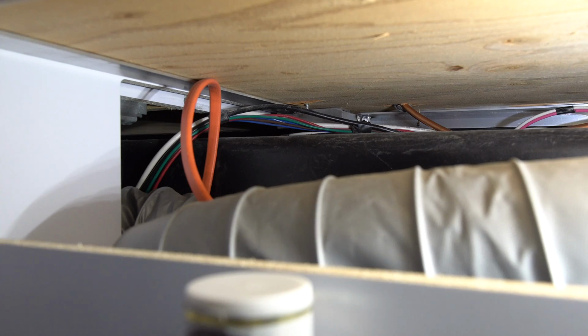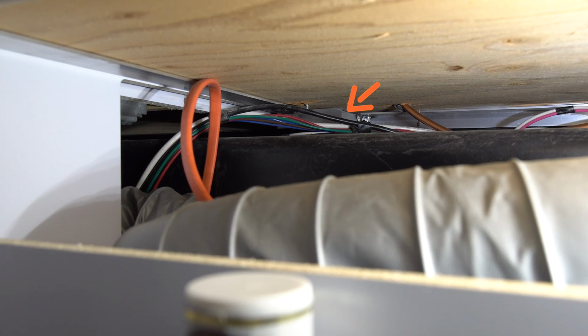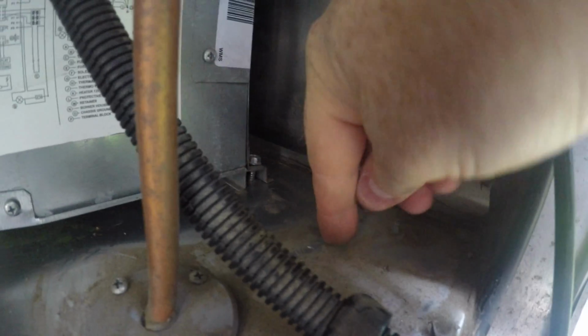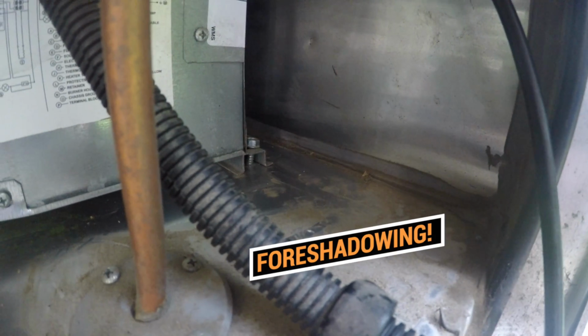Okay, so looking underneath, I can see that this pipe comes around like that and continues that way, right? So I don't want to drill here. I just don't want to get into the business of trying to navigate around a propane pipe. I could also see that this fridge screw was there and that right behind it a couple inches I was in the clear. But once I got back into this corner, there was some sort of big aluminum block or frame member. So I did see that alongside this aluminum pipe seemed clear and behind this seemed clear. So I'm actually going to split the difference and drill right there and hope for the best, right? Maybe I'll cheat a little bit, go a little further in so I can avoid that pipe. I can't tell anything by poking on this because there's nice plywood underneath, but I think if I drill right here, I should be good. Who knows, I may live to regret it, but we'll see.